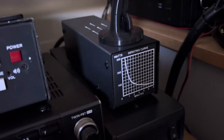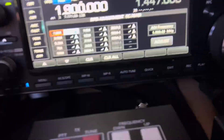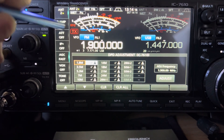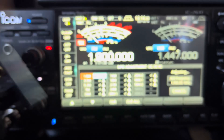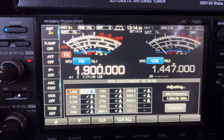I've got a 300 watt dummy load, but it still needs 100 watts for a few seconds. We'll start at the top with it on FM. On the second adjustment, you click OK and watch the needle — it will calibrate the output.